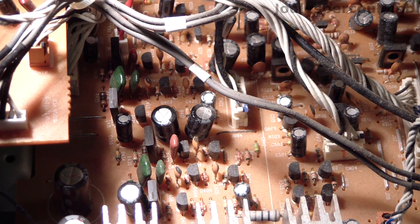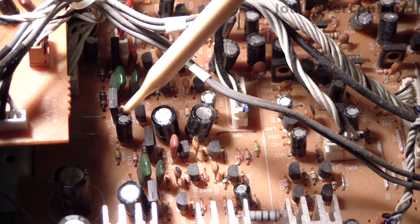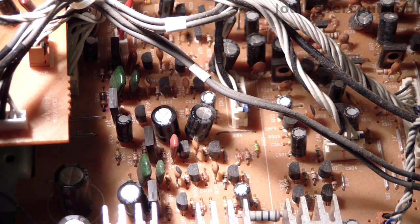I can also see that next to each transistor is a discoloured resistor, so clearly they've been overheating too. There are a couple more discoloured resistors in this area, down here, each next to another pair of transistors in exactly the same packages as the overheating ones. Now these two were quite warm, but not absolutely burning hot as the first two were.